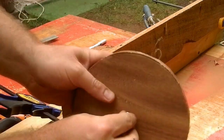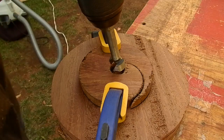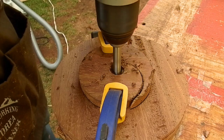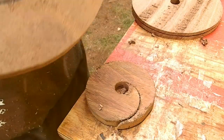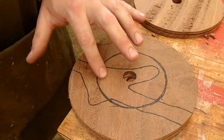I did this twice for two circles — for the top and the bottom of the lamp. Then I drilled the holes for the top part, drilled for the cable, and on the bottom part I drilled to put the jigsaw inside and to drill the circle so it would let more light underneath the lamp.